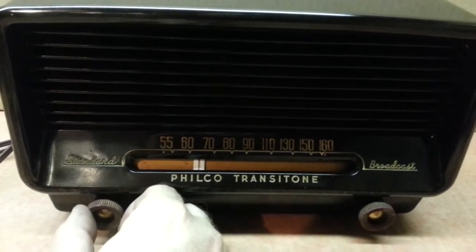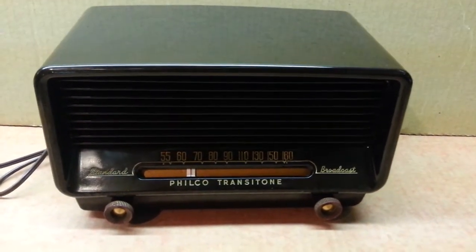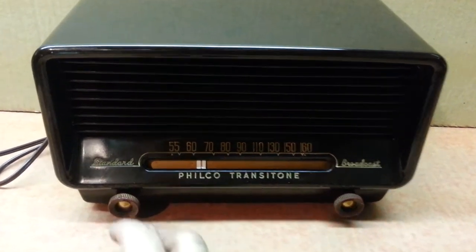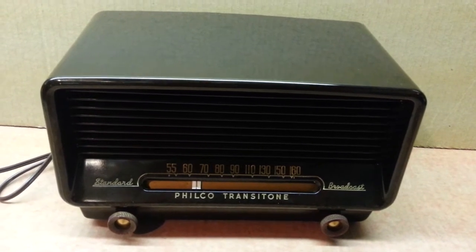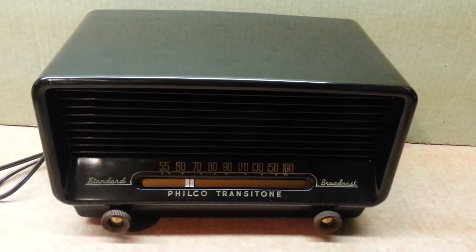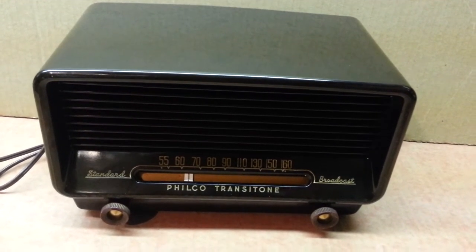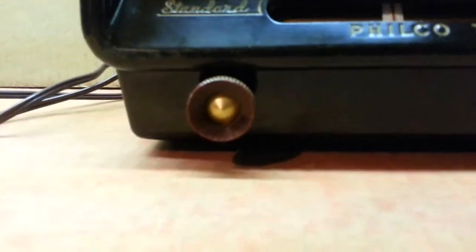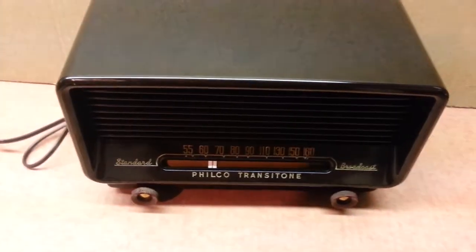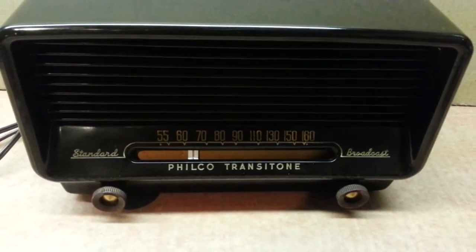I didn't set up the AM transmitter or anything — I just wanted to do a quick video to show these two radios. It's one of those things I'm going to be selling at the meet. I'm not looking to make a great deal of money on it; if I could make five or ten bucks I'd be happy. It's nice when you can bring a radio back to life and pass it on to someone who's going to appreciate it. Basically just replacing the capacitors and a 50L6 tube was pretty much it. I repainted the gold in the knobs and put a lot of elbow grease into the cabinet. I think it's got a nice shine to it. Here's the white on the needle — the dial indicator.